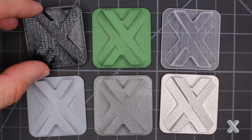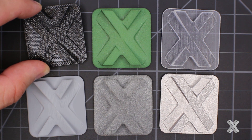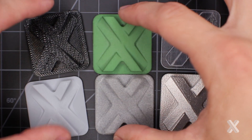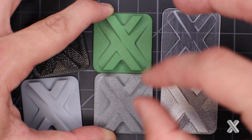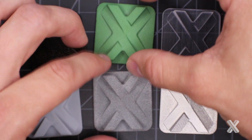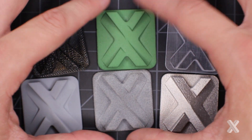FDM extrudes parts out through a filament, layering by layering with an extruded plastic filament. ABS, Ultem, polycarbonate — these materials can be made using fused deposition modeling. SLS and MultiJet Fusion use nylon as their base material, and both have a similar outcome where parts are fused together with that nylon material, but they have different ways of doing that fusion. The surface finish is typically matte from the get-go — kind of that matte, almost fine sugar cube type finish, a medium level finish.